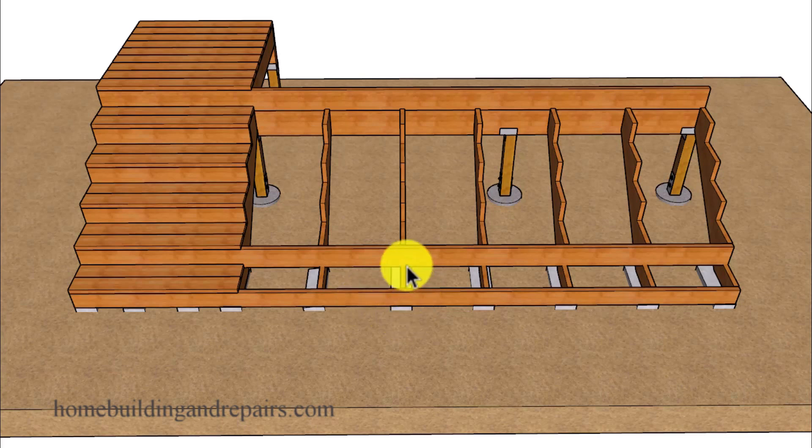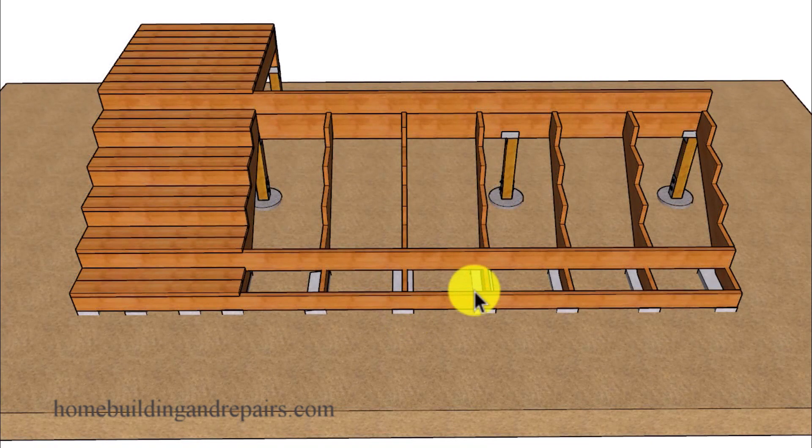Keep that in mind if you're going to simply place a few blocks or pavers underneath your stair stringers to save a few dollars, or if you just don't have enough money. Just be prepared for problems in the future. A helpful solution would be to use screws for everything so that you can unscrew some of the treads and risers to access these areas for easier repairs in the future.